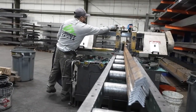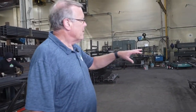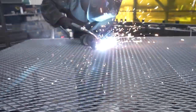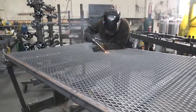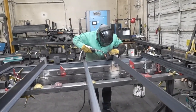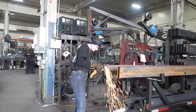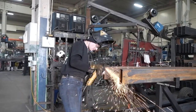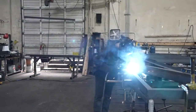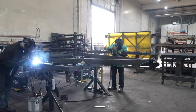Let's go take a look and see how they put this stuff together. Over here is our line for the utility trailers — smaller things like people use around their house, or landscaping companies. This team is going to build on the jig, the frame first, and then install the side panels, the rear gate, fenders, suspension — all of that. The jig is really important for us. We don't do a lot of hand building. It's great for consistency — everything's square, everything's the same.